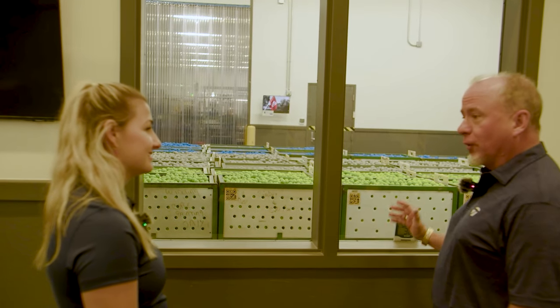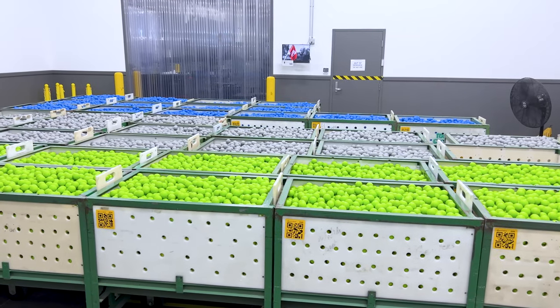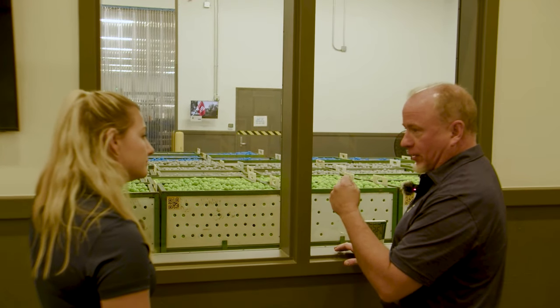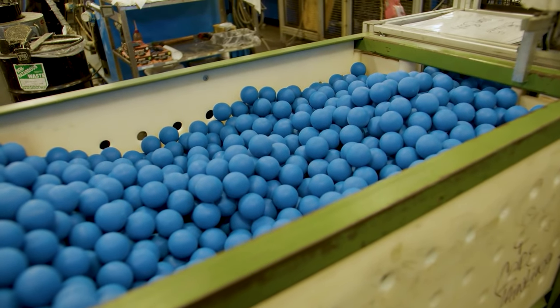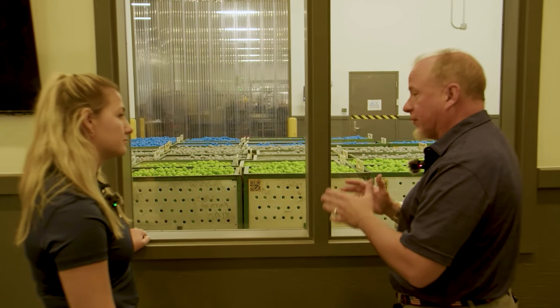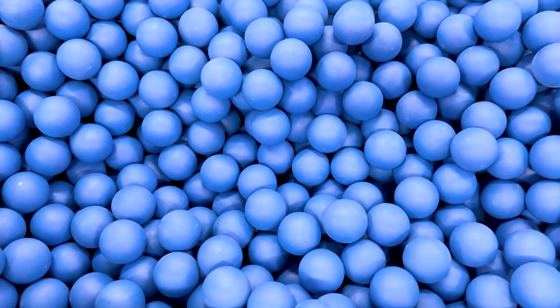If you're into colored patterned golf balls, this is going to be a treat because some of the stuff in here is amazing. This is the mantle cooling room, nicknamed the nursery because it's full of little baby golf balls. This is the mantled core — you have the rubber compression molded core and the injection molded layers that go over the top of it. These are the middle cores getting ready to receive the final urethane cover. They're held at a certain temperature to ensure the proper size when casting is complete.